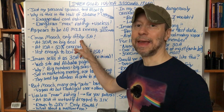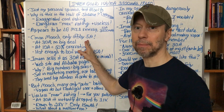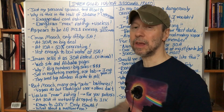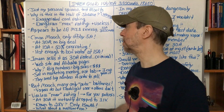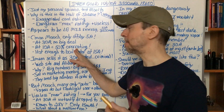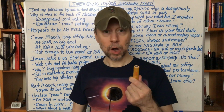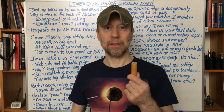Now, you may be saying, hey, come on, Mooch. Their 15 amp rating is only off by 5 amps from the 10 amp rating of what I think this is. Well, at 30 amps, that's no big deal. 30 amps, 35 amps, that's not a huge change in temperature and cycle life or anything that might affect performance or safety of the battery. But for a 10 amp battery, rating it at 15 amps, that's a 50% overrating, and that's huge. This battery got hot enough to boil water when discharged continuously at 15 amps. There's no way in hell you can say this is a 15 amp battery.